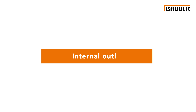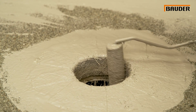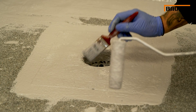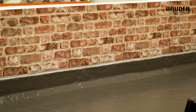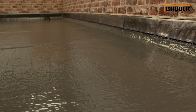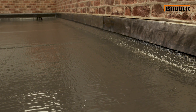On an existing internal outlet, the detail is prepared and the embedment coat is applied into the bowl or throat of the outlet and reinforced with the glass fibre mat. Again, after curing the top coat is applied. The roof is completed and the monolithic waterproofing delivers a strong bond to the substrate, be that for a refurbishment project or new build, overlay, cold or warm roof scenario.